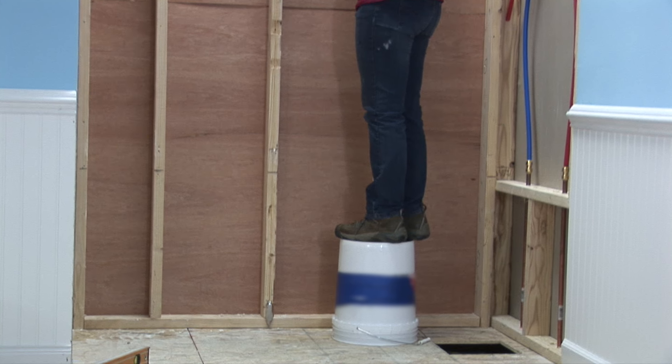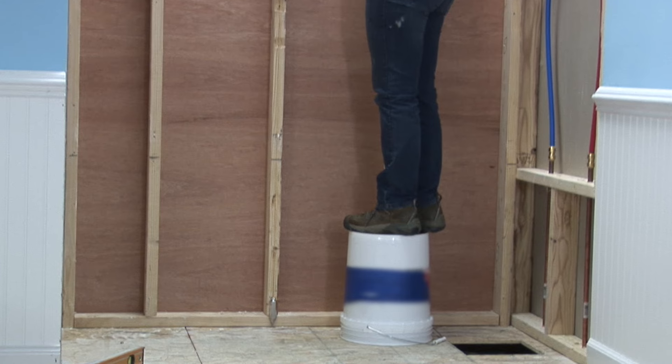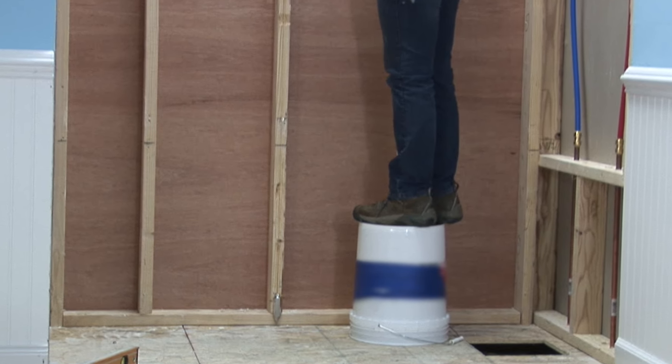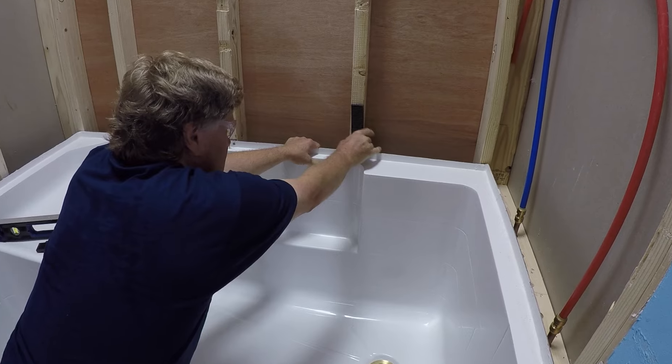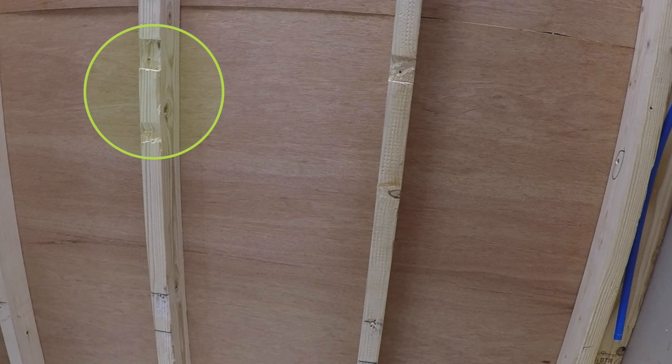Start by hanging a plumb bob from the framing beginning at the back wall — this is critical to your installation. In this demonstration, the wall was not plumb. A solution is to either shim the pan away from the wall or notch the stud. This is critical to a proper installation of the back wall panels, as slight variances will affect plumb walls and uneven grout lines.